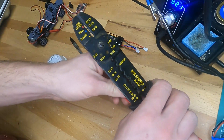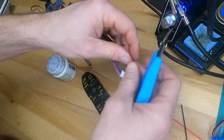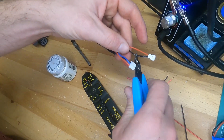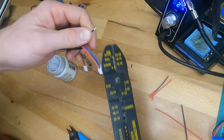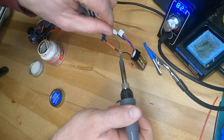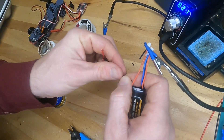For the electronics we've got a newer smaller 2S LiPo battery that should fit better inside the body, but unfortunately it came with the wrong connector so the first thing we're going to have to do is solder on a new JST plug to match what's on the ESC. The important thing here is to remember to only cut and then solder one of the battery wires at a time so that the battery doesn't have a chance to short.